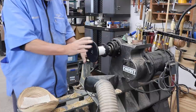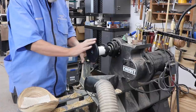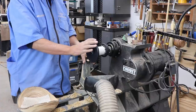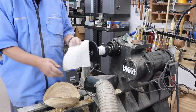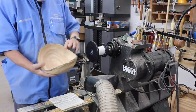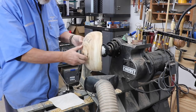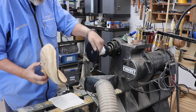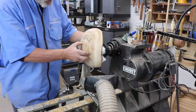We'll put this on the spindle. One really nice thing about this is it's always trued up. When I use my drive blocks, I usually have to true those up. What comes in this kit is a little bit of shelf liner. This hard plastic won't mar the inside of your bowl, but it will slip. It's a drive chuck, so we want to make sure we put that shelf liner in there.